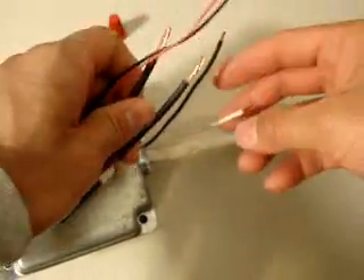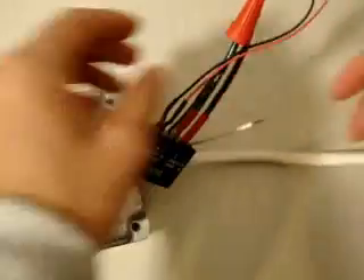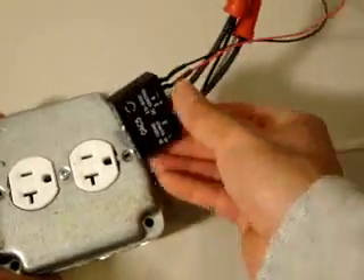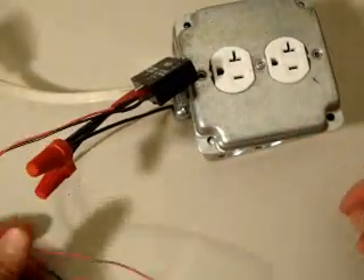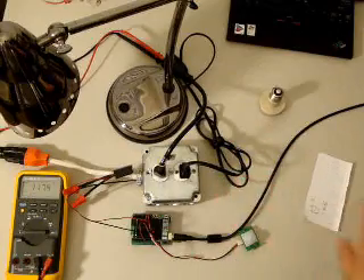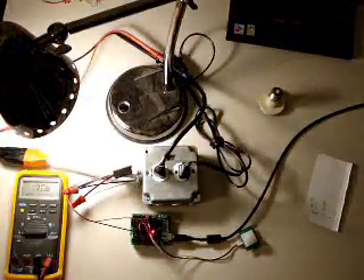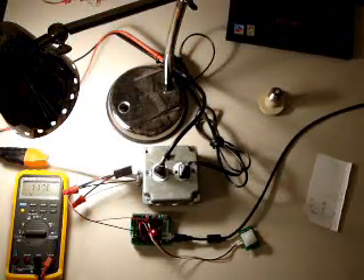Here we have the two wires for our tap. We're just going to connect the solid state relay up to the outside here with a couple of additional wire leads. There's no polarity — it doesn't matter which cable goes where as long as you're using the AC side of the relay. Now we're going to connect the two DC control cables up to the Arduino board. Here we have all the components hooked up: the Parallax motion detector controlling the LED, turning it on for 10 seconds every time it detects motion. The solid state relay is now hooked up to the Arduino board as if it were another LED light, and we have a lamp plugged into the outlet with an additional tap to show the voltage out.